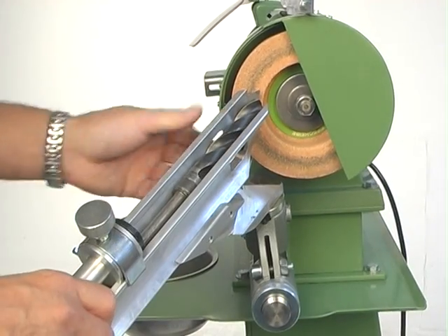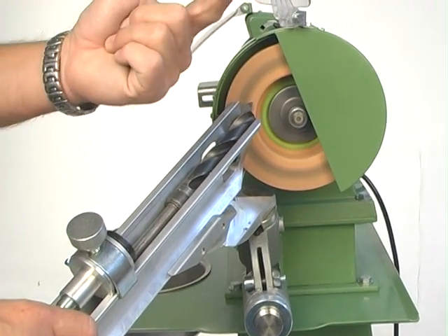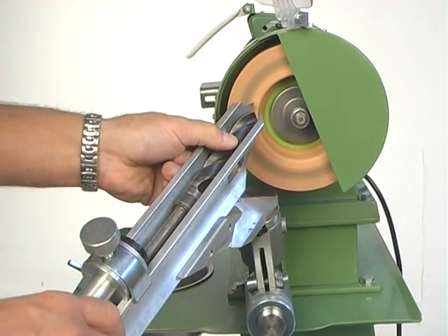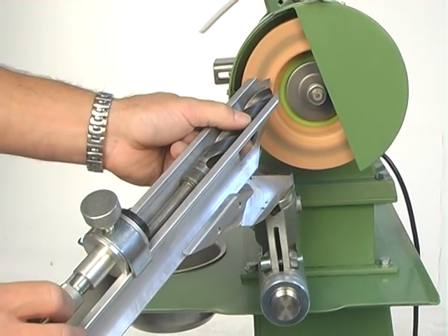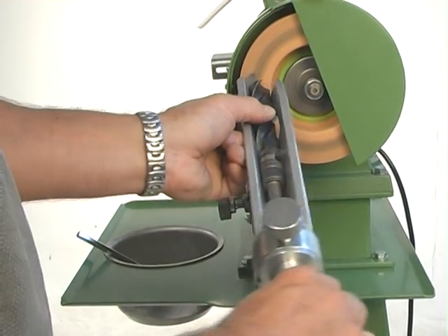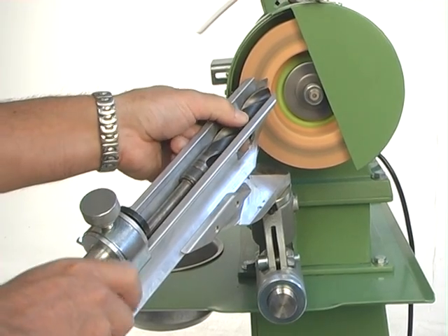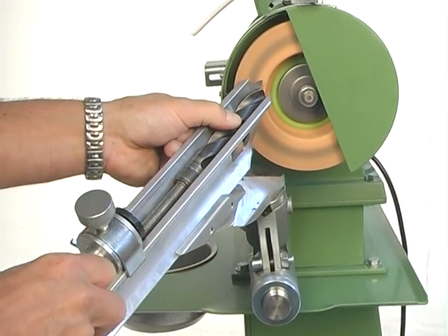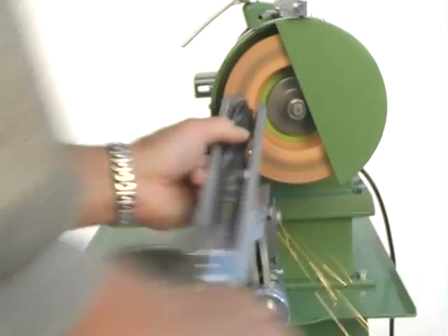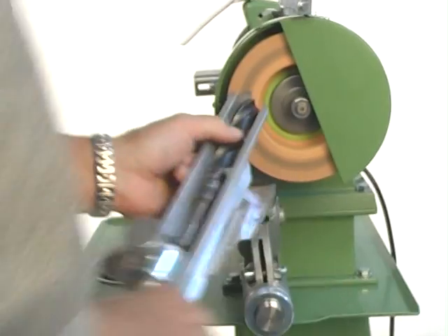It's just free of the stone. Then I turn on the machine, and it is clicking. That's what I do with my two fingers — one underneath and one thumb on the top. Go like this. Now you can see it's not touching, so what I do is push it a little bit forward with the screw down here. Still not touching. You only want to touch a little bit. I continue till there's nearly no sparks left. Then I have a good finish.